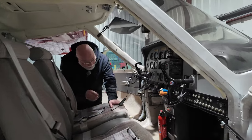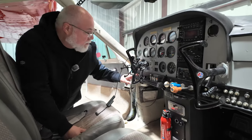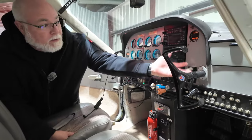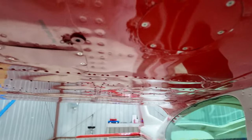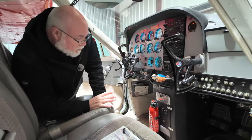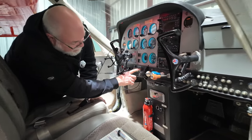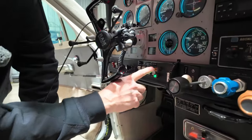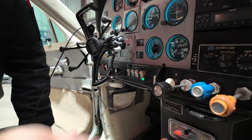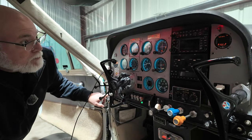And then we end up with just retracting those flaps after we've done our last fuel sump, so battery on. Flaps up, make sure they go up. It's another chance to hear the flap motor without any engine noise. And just one last look over everything before we shut it back down again. We also notice that we have the green gear down light. We can also test the other one to make sure the up light works. So we know our lights are working there, and we know the gear's down because we're on the ground. We'll go ahead and turn that off.